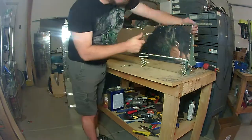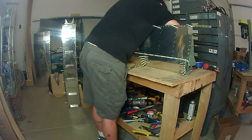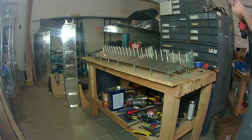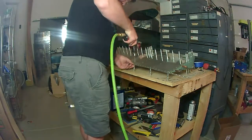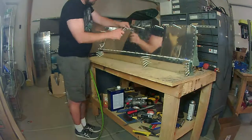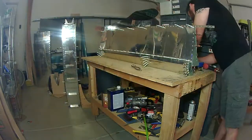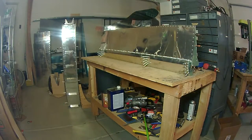When you start riveting the skins together I end up using a right-angle aluminum piece to hold everything together. Here you see me putting in the rear joints — like the rudder, you put the piece in, mark it off, and cut it to length. You want to drill perpendicular to the piece, not the skins, and the instructions talk to that a few times at different points.